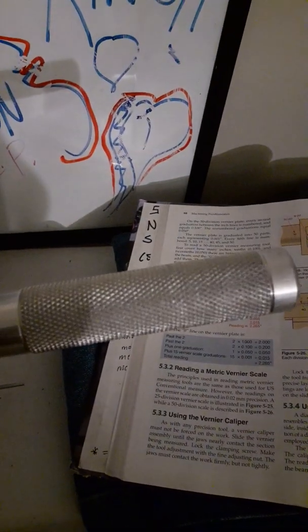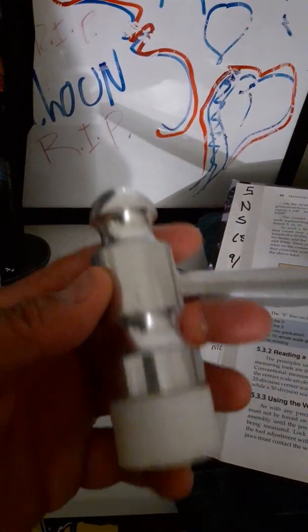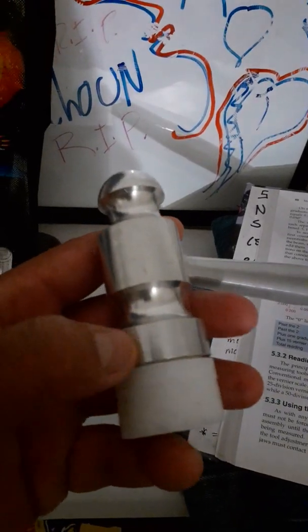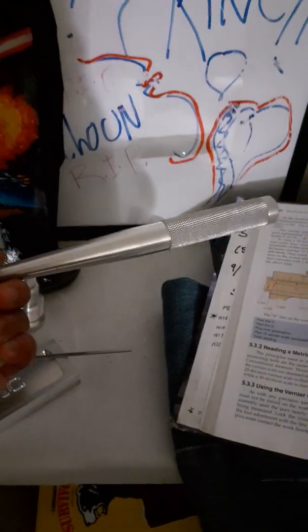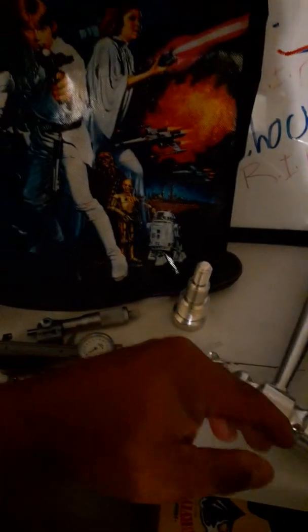And then we made this cool little machinist hammer. We knurled the back end there on a manual, conventional lathe. Then we did a taper. You see how it tapers? And then we got this little head here, and then we had to put this piece of nylon in and mill out the inside of this. It was a lot of fun. So this is one of the projects you're going to do at the school. There are others. I just brought out 3 of them.